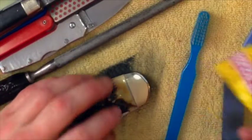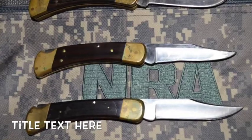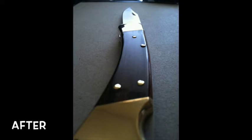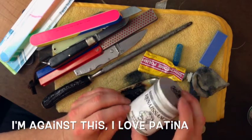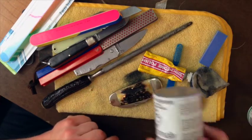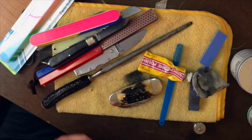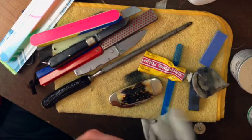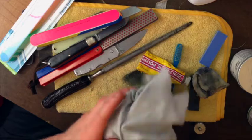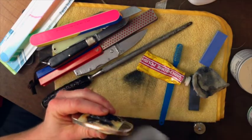This is that chrome polish I'm talking about — there is a link below for that. This works wonderful for your Buck knives that have the brass bolsters. Those brass bolsters might have a nice brown patina on them — you do not want to remove that. When I sell a knife, I do not remove it. Those green spots and that brown look can be removed very easily with this chrome polish — literally it's a five-minute job. But in my opinion I don't think you should remove that. I leave that up to the person that purchased the knife. Removing patina on a knife really destroys it and destroys its value.